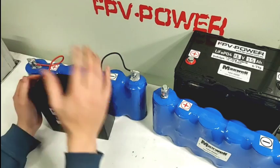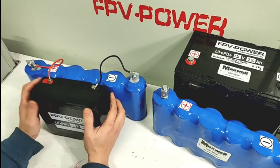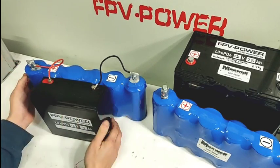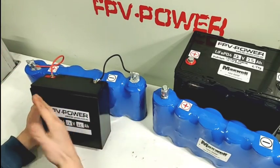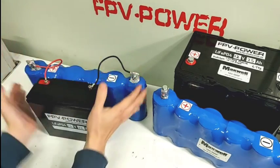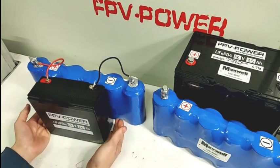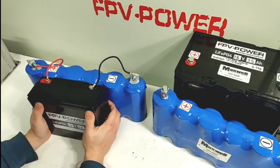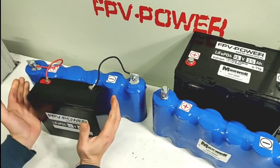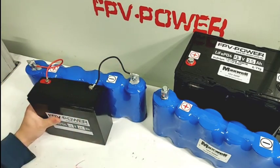It's stable, rock solid. When you're talking about a lead acid battery, you leave it uncharged, sitting there for 3 weeks, 4 weeks, after 2 weeks the voltages are going down. Then it's all downhill after that. The life cycle of lithium iron phosphate, if you were to discharge it to 100%, our application is for cranking so you never do that, but just to give you an idea of life cycle, at depth of discharge 100%, 2,500 times. If you did it every single day, that is 6.88 years that the battery will last you. Meaning empty, full, 1 day. Empty, full, charge back up, full, second day. Do it for 6.88 years.